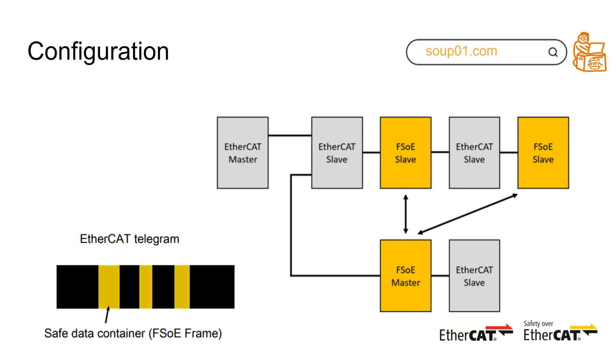For white channel, you need to make your own cables and your own path, which costs a lot. The other type is called black channel. Black channel means the safety data is sent over normal communications. The safety is handled between the safety data sender and receiver — the sender generates safety data with CRC, timestamps, and other checks, and the receiver verifies all of this data is correct before deciding whether to use it.